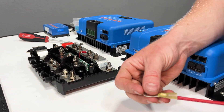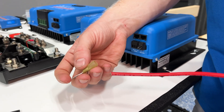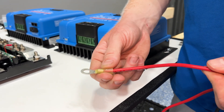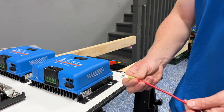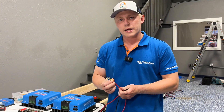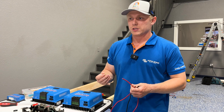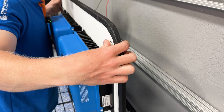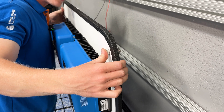On connections going to a post, we're going to be using heat shrinkable connections. This is going to be crimped onto a wire after it's stripped and then heat-shrunk with a heat gun, which ensures you don't have any moisture getting in — especially important in a marine environment or a camper van.